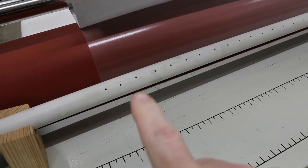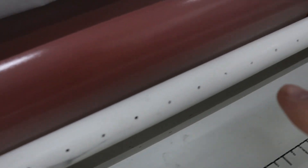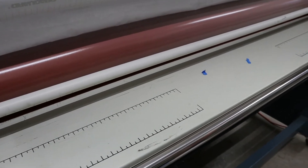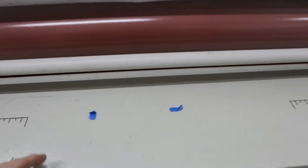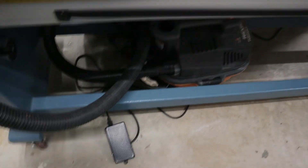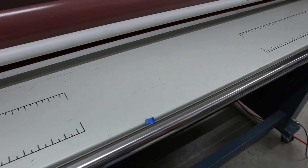All right, so I turned that line around so you can kind of see the drilled holes that are creating the air curtain itself. I don't have a lot of extra dust, so I've just taken some masking tape, folded it over on itself to create some large, quote-unquote, dust that would be in your way. Just use the foot pedal down here to turn it on, and you'll see it does a pretty good job of quickly dispersing the dust.